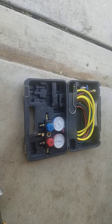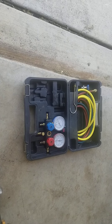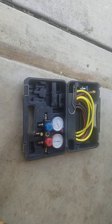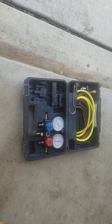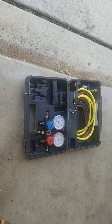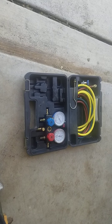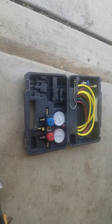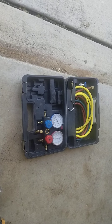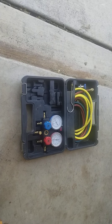Once we go back with the repair, my next favorite thing is to put some dye — even though I just fixed it, I'm going to put dye. You have to use it in moderation; you don't need eight ounces. Depending on the size of the system, one or two ounces is enough, because wherever the leak develops, all the dye is going to come out right there. One ounce of dye will come out in that one spot.